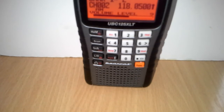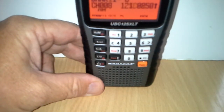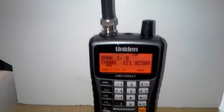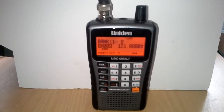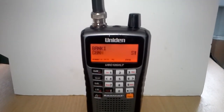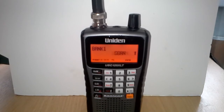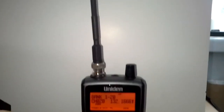I'm now going to put the D1000 on, which is a purely civil-based, civil airlines, civil band antenna. It's 22 inches in length, cut for civil band and works excellent. It will also work on marine band and on 2 metre handheld band. It will give a little bit of reception on military in the low part of the military band, but I wouldn't use it primarily for military. As you can see, it's quite a big aerial and it works quite well.